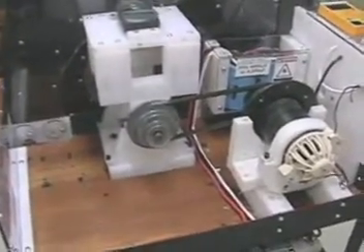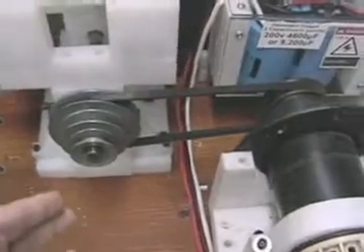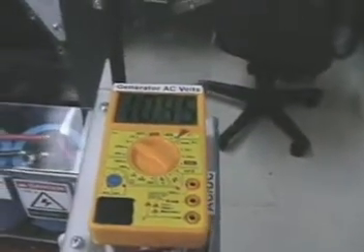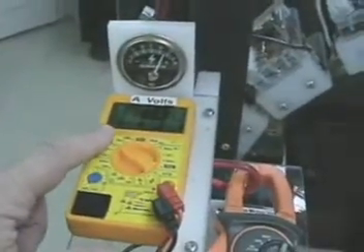With that I'm going to run the wheel and give you a look at it running. That's the output of the generator — you can see the wheel is driving this small generator with a pulse motor. It's a sequential pulse motor and it's gaining in speed. You can see it's now up to ten volts. The ten volts is currently going into the caps and being fed back into the system. That's the charge bank and that's the source bank.